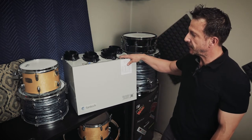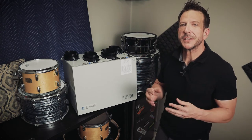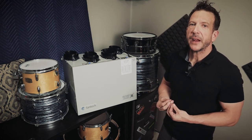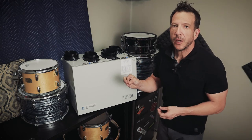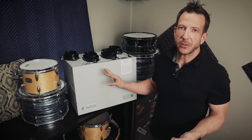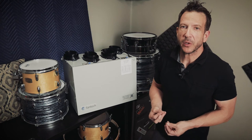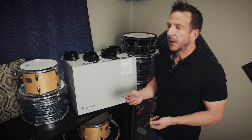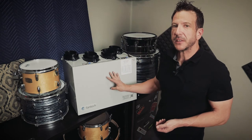The way this system is designed, it is transferring what we call sensible energy, and that really has to do with the temperature that you would read on a thermometer. What this doesn't transfer is what we call latent energy, and that's really associated with moisture or the water vapor in air. You can get energy recovery ventilators, which have a different design inside.